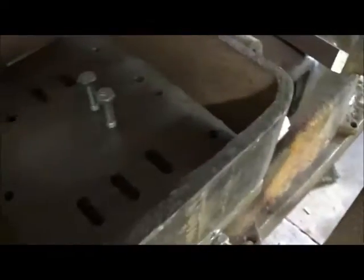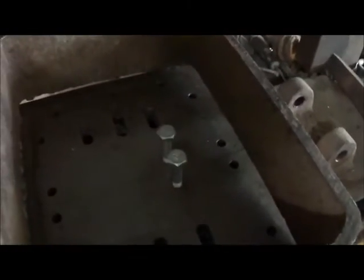I was assuming that because most two-cylinder engines I see are not made together — there are two separate cylinders and two separate steam chests. But with this one being together, there's no reason why we need this. I've never seen one that was able to use the same steam chest for both cylinders, so I didn't go into it thinking about it that way, but I think I've figured out we'll be all right without it.